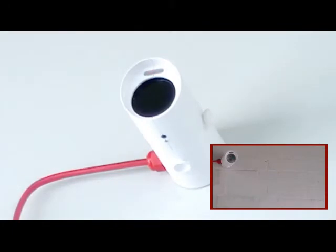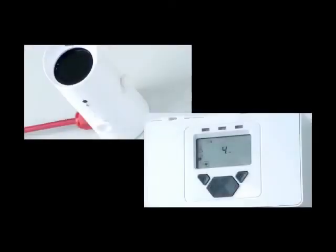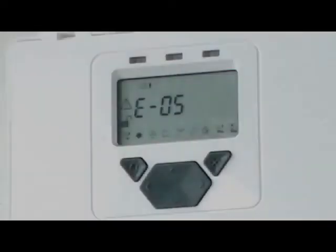If you cannot see the laser, refer to troubleshooting. Now that the receiver is correctly aligned, press the laser switch on the receiver or press CROSS on the system controller to turn the laser off and exit to the engineering menu. With the receiver aligned, we can start the alignment of the transmitter.